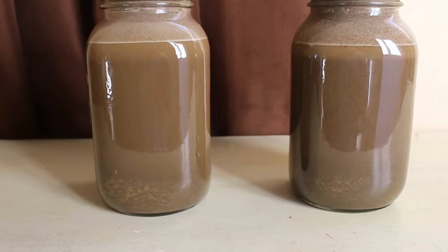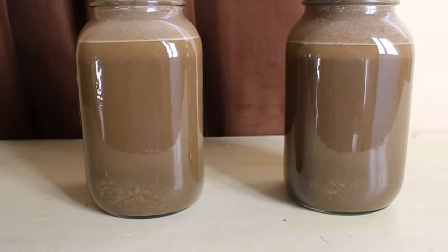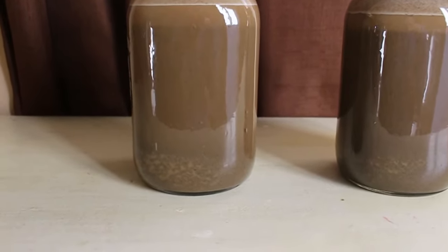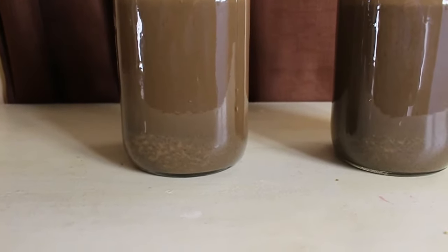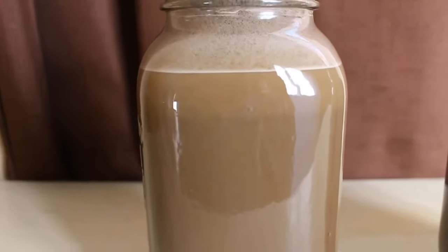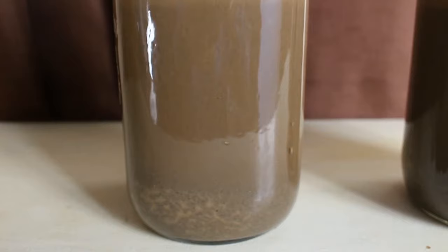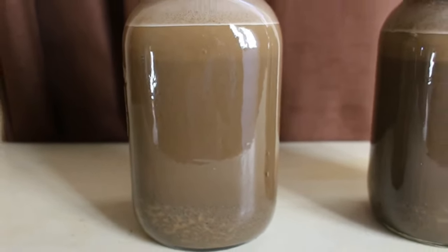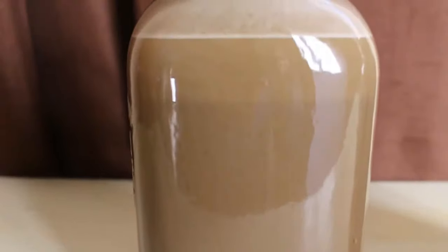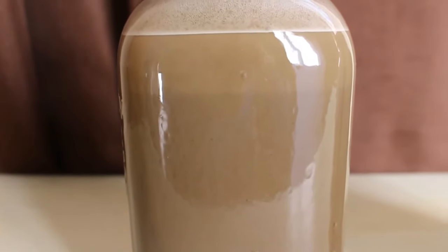The timeline goes like this: in the first five to ten seconds, all the sand and gravel drops out. Then over the next 30 minutes, you should see all of the silt drop out. You might not even get a distinct line there because all the clay in the top portion will still be suspended in the water. It's going to take 24 hours or more for all that clay to drop down into the third layer. I'll then take a new video for both samples to show how much ends up being sand, silt, and clay.